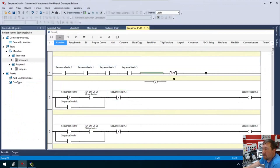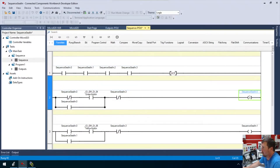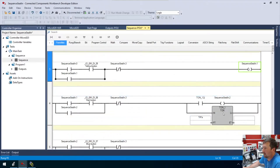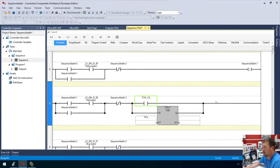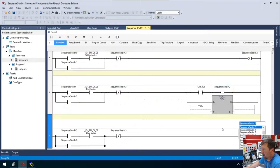Adding the latch instructions — we delete the existing outputs and paste in the latch instructions numbered one, two, and three, working through each rung of the program to replace the seal-in outputs with the corresponding latch coils.